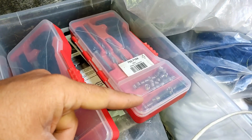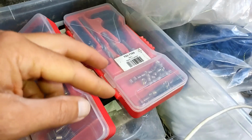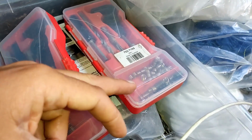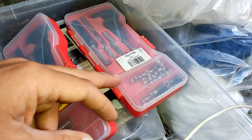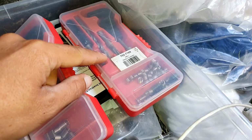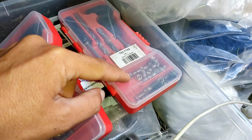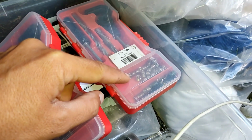Their advantages are they're actually quite easy to fit once you know how. There's a few little tricks, but it's also their downfall in fitting them. If you don't use the tricks, you can cock them up really easily. So basically it involves using the drill that is suited for the tap, that is suited for the external diameter, or external thread, of that particular thing.